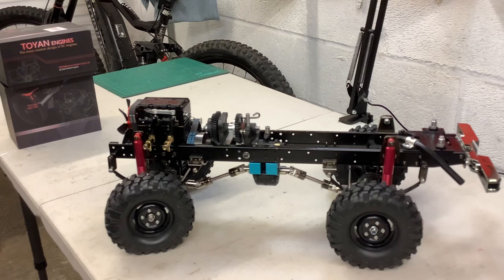When they came with the Kyosho, I think it was a Moon Eyes they did, and a Phil Buggy and a few other cars with this gearbox configuration. I built a Baja or Phil Baja Buggy and I swapped out the very lame Kyosho GT engine and put in an OS car engine — the OS 26. It revs to about 18,000–20,000 on an open pipe. I've been running that Beetle and this gearbox takes whatever you throw at it. It's never let me down.